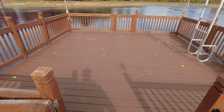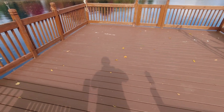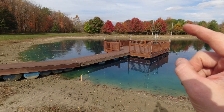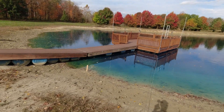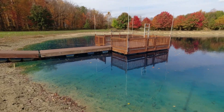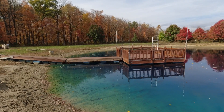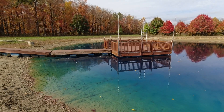The Trex decking is definitely the way to go — no splinters for the kids. If I could do it over I may opt for a lighter color because this gets very hot in the sun, however that shade we put up here does a nice job of keeping things cool. The dock has 24 barrels underneath it; each of the gangways has seven. If you're looking for barrels, check Facebook or Craigslist — I found a guy who had hundreds of them. All lumber on that dock outside of the decking is pressure treated, and it has been stained once, about two or three years ago.